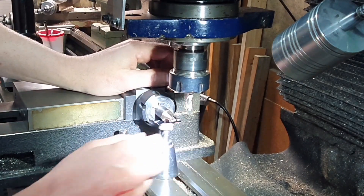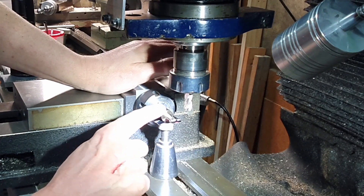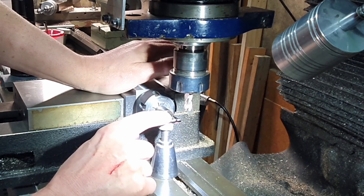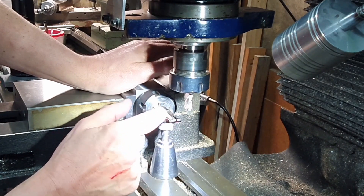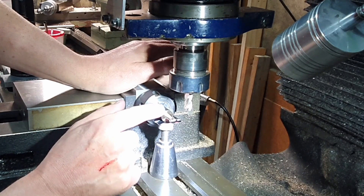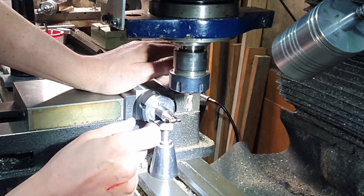That's all supported and shouldn't be too much problem - I'll take it nice and easy. We are going to now machine this top face down, get it down to just above this. We want a quarter of an inch finish size. This is 6mm so we've got a 0.35 split between the two sides. We'll machine that down and then flip it over and machine the other side down to get down to our quarter inch.